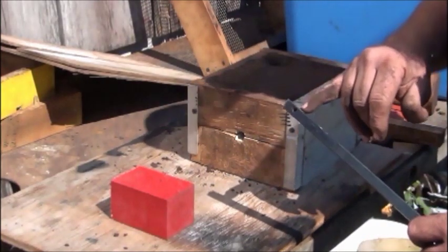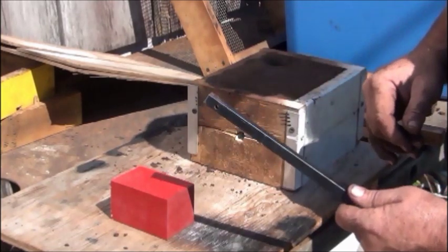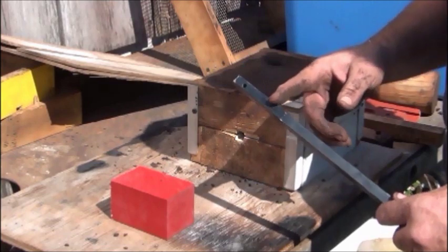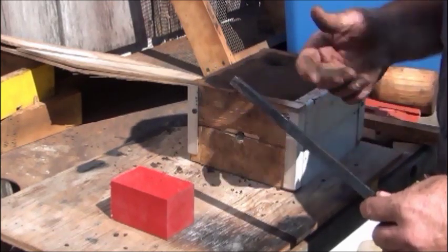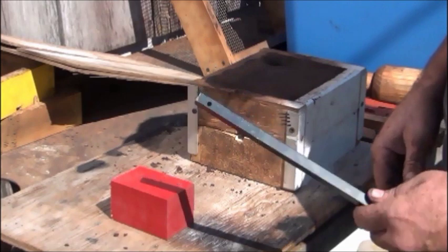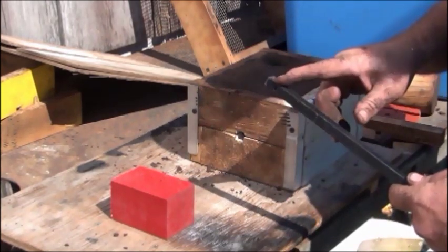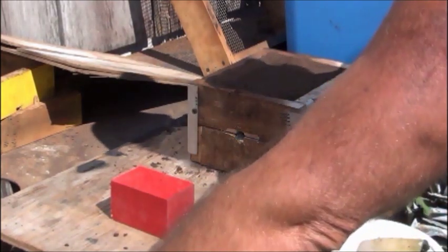Now this one actually has been in the right spot. It has a hole through it already, the way they were made with the plastic on there. On the other ones, I usually just cut a few grooves in there with a cutoff tool, or I've even filed notches in before just to give it something to hang on better if it ever happened to loosen up. With preheating it and everything, it bonds to it pretty darn good.